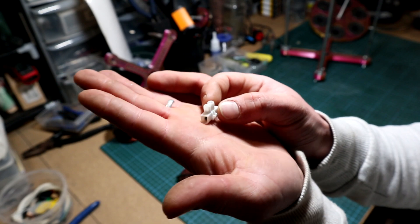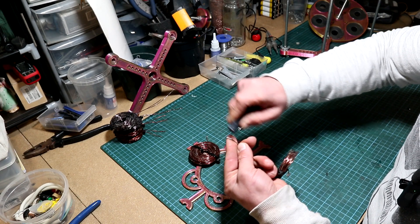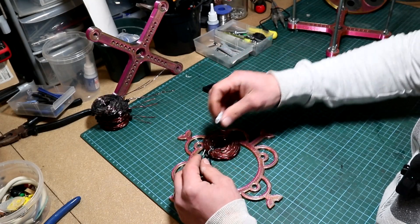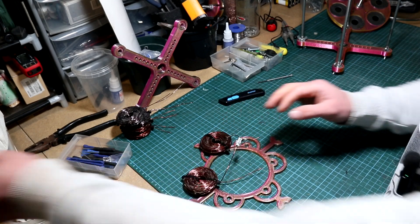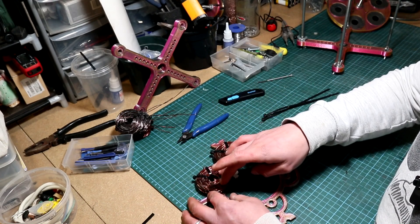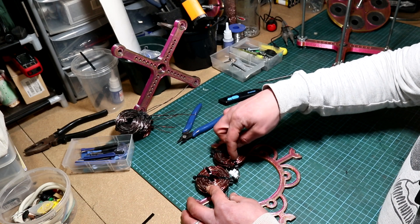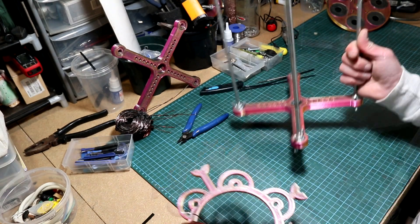Normally in a generator the second row of bobbins are wound anti-clockwise, so you don't have to flip it — but the way I did it, you have to flip one. From the first coil connect the ending wire to the second coil's beginning. I chose to go with these connectors rated at about 5 amps. We get a small knife and scrape away the varnish from the wire to expose the metal, then connect them together and place them onto the stator, securing temporarily with zip ties.